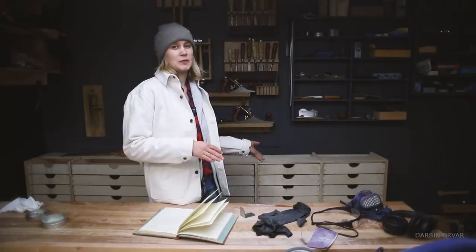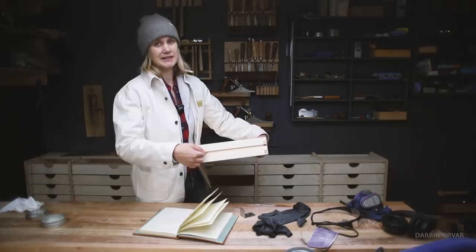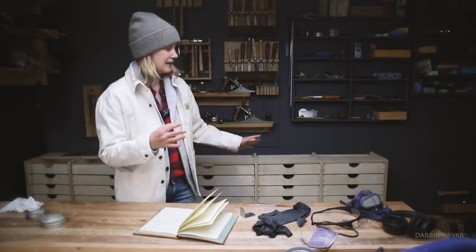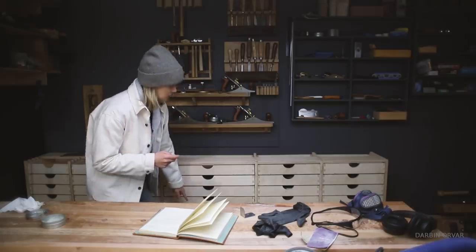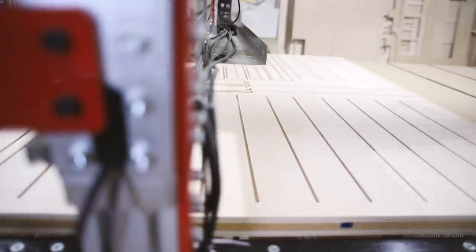Working on this project I've learned a couple of things, particularly about allowances. It's not a great idea to make things too precise where it's a little bit too tight. When I first designed the drawers, I made them half inch exactly and the wooden slides were half inch too — just a little tight. So I increased the tolerance just a touch to make movement easier. Similarly, I first wanted the drawers three inches high, but that felt tight too, so I brought it down to 2.8 inches to get a bit more space between drawers.